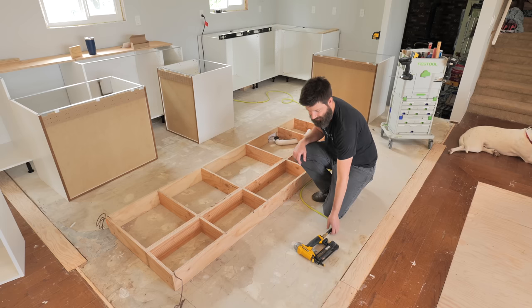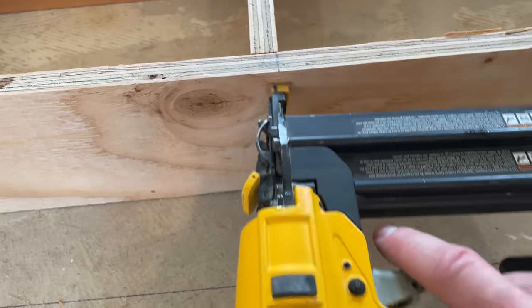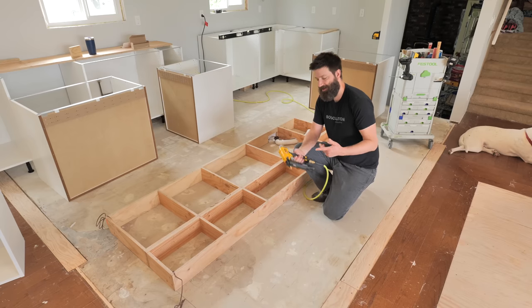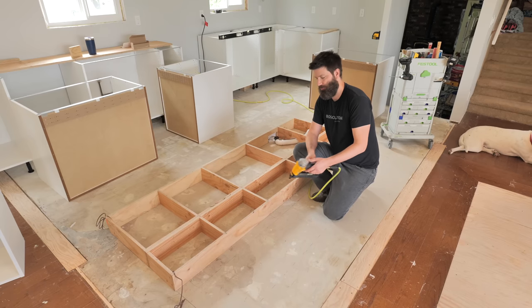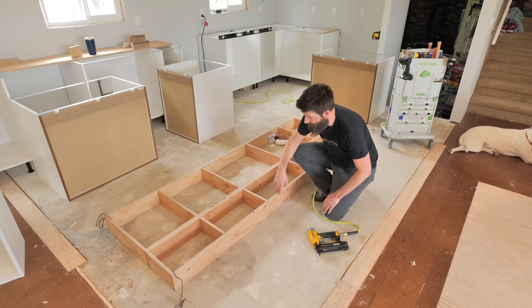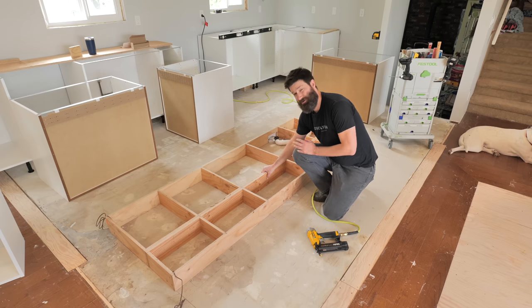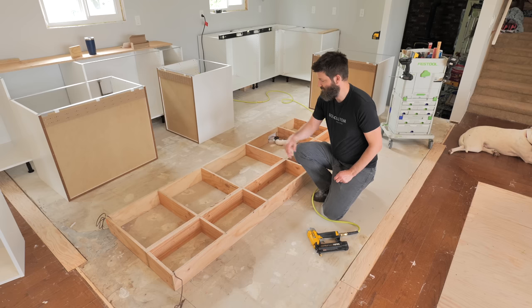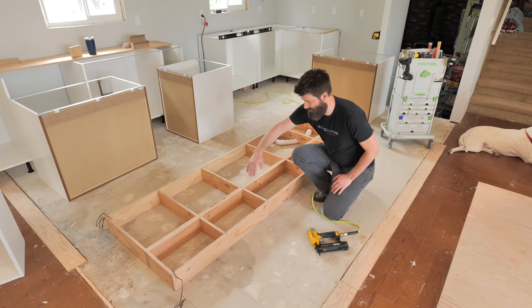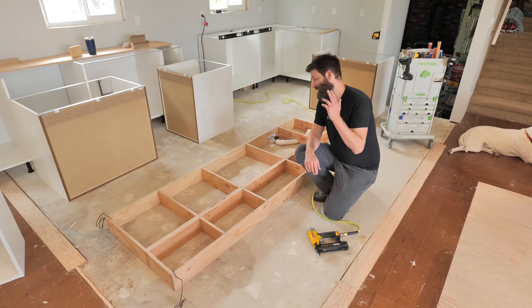When it comes to nailing it together, I've just used an 18 gauge nailer — inch and a half nails, super quick. You could screw it all together but that would take a long time. You don't need any glue or anything like that, just nail that all together. For this middle piece, I have done two separate kicks joined together, which makes it a little more robust along that middle section. If you were short on materials, you could go cross pieces all the way across with a little extra support in the middle, but this is my friend's place so I went the extra step.